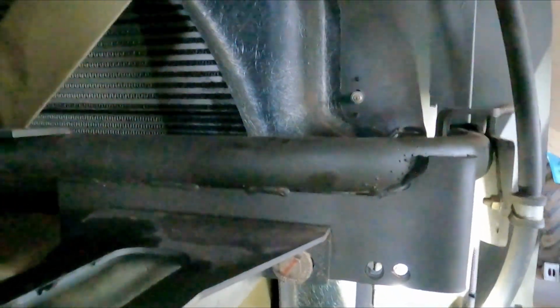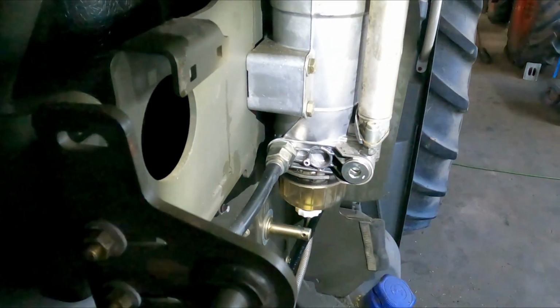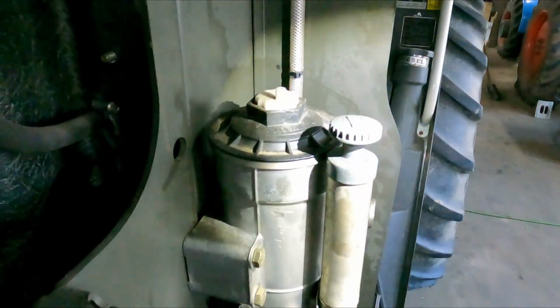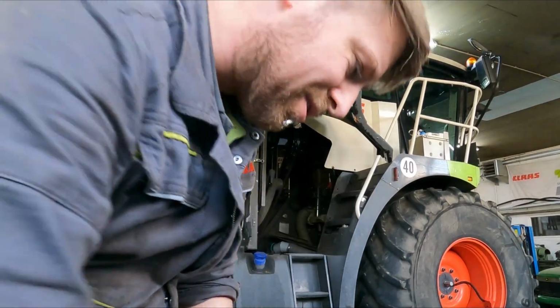And I gotta turn around, careful. Pull your fuel on this side of the pre-filter. Now I've got a pump that I use all the time that's unfortunately at work. If you haven't got a pump, obviously we have a hand pump. And if you use a hand pump, you will eventually hear air purging out around the main filter. So you should hear at some point diesel returning to the diesel tank. You only need to pump it another 400 times.